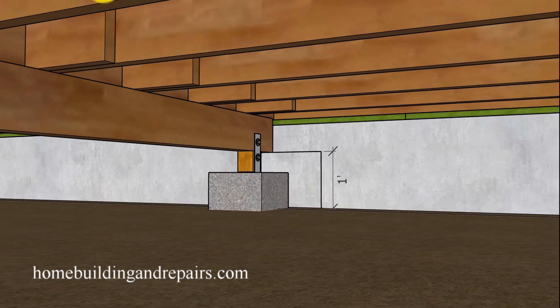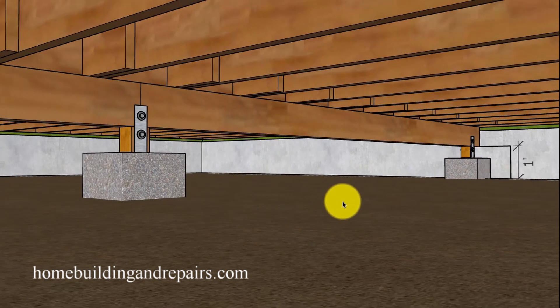The reason for that, I think, is because they want people who need to get underneath the house to make repairs to have a little more room in the larger areas. The 12 inches gives them enough room to crawl under but not be as confined. If this was all 12 inches, it probably isn't going to give you much room to work. Feel free to share your comments with your reasons if they vary, or even if you just want to point out something I already said in the comment area.